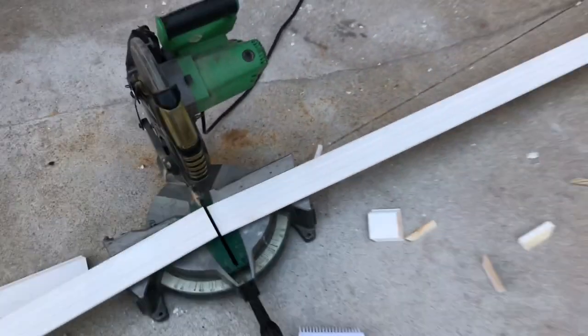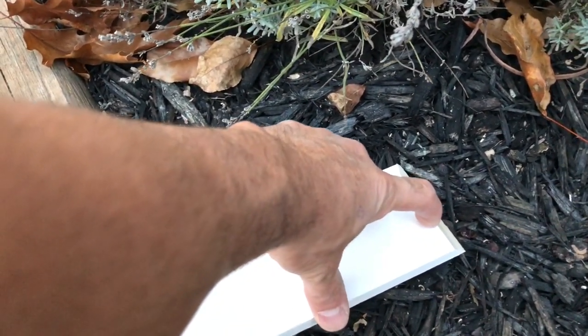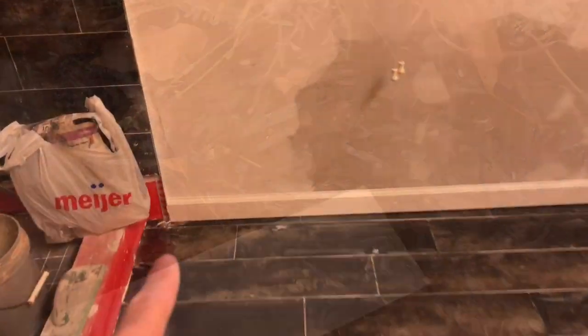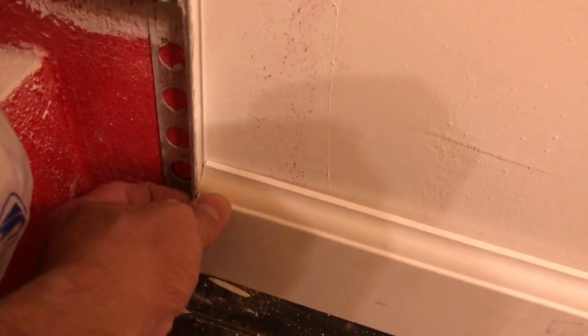Cut the trim where it's backwards, because that's a more accurate measurement, being that you are taking measurements from the back side and not the front side. Due to 45-degree cuts, you don't measure it from here, you measure from the distance of the longest part touching the wall. So there's the flat piece that we put in up against the Schluter trim. Don't mind the extra caulk or whatever that is, drywall compound that we put in. So I got it lined up. I knew that this area here had a 45. Like I said about that common sense thing, you can't buy it, you gotta have it. But there's the flat side there, and that's how they meet up.